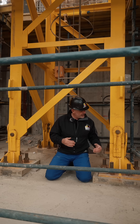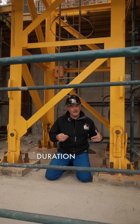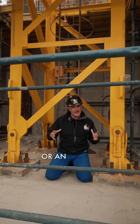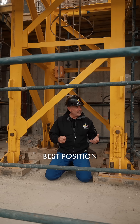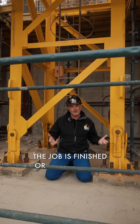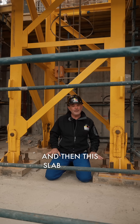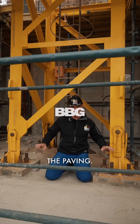Once this is cast, we lower the crane pieces down, connect them, and tighten the bolts. The crane stays up for the duration of the job. We create a hole into the building — normally a shaft or an atrium — and choose the best position. Once the job is finished, we take the crane out, cut off the bolts, and the slab remains below the surface bed or paving.